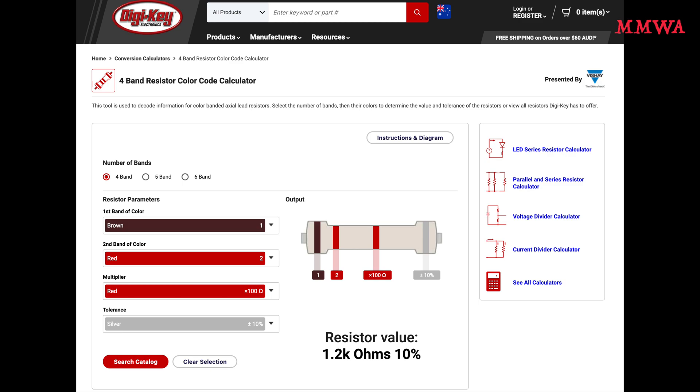The other thing is they used a carbon resistor, which is not good. In the high temperatures of the engine bay, its resistance value will actually change. The metal film resistor is way more stable at those kinds of temperatures.